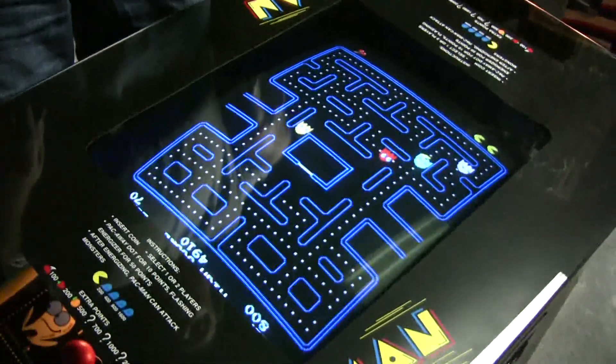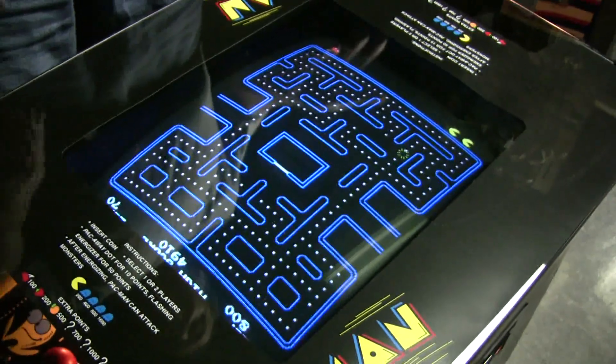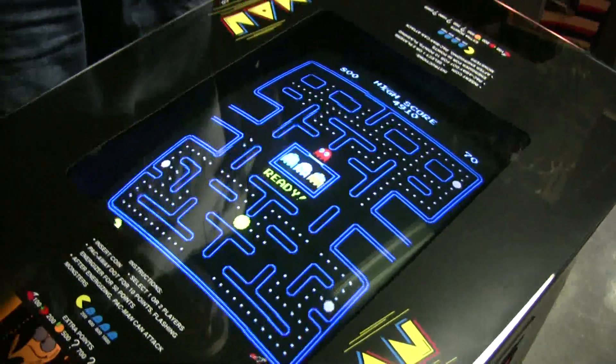Are you aware that on a cocktail table, the logic board has a built-in flip circuit? So when you put a regular Pac-Man logic board into a cocktail, there's a jumper in the edge connector and it tells the board it's in a cocktail table, and the screen will flip all by itself. You don't have to flip a dip switch — very easy. That way you have one board that does everything and no dip switch to flip the screen. Pretty clever of Bally, huh? Great game, great system.